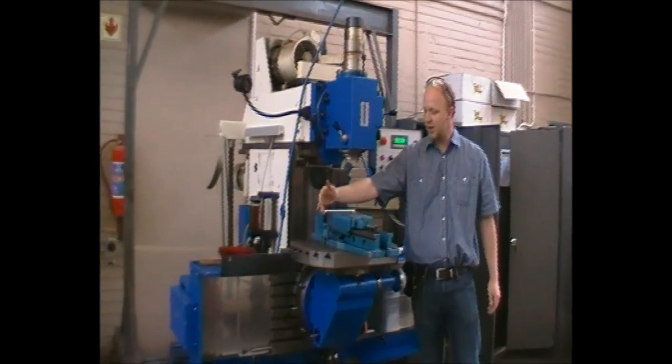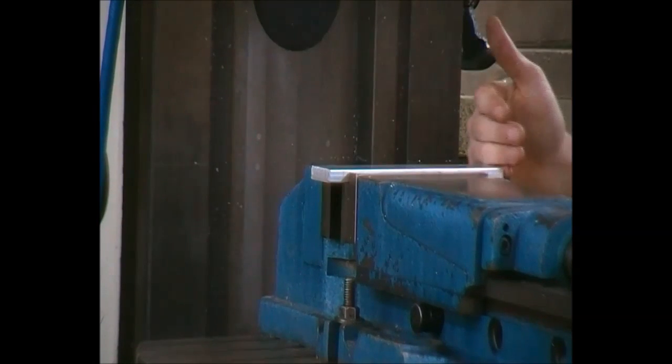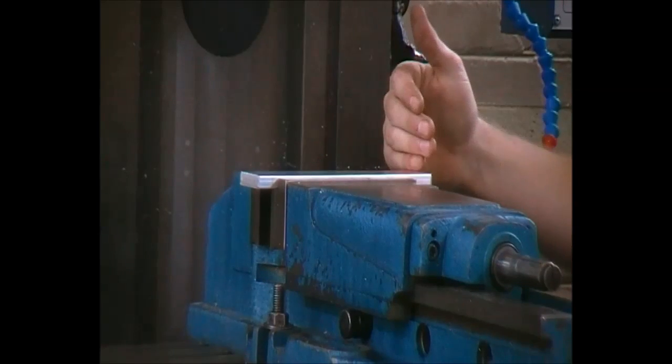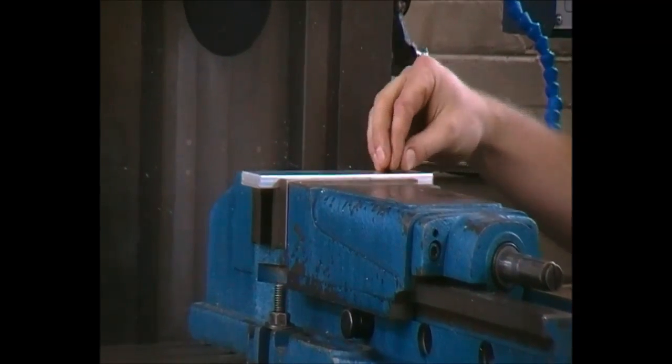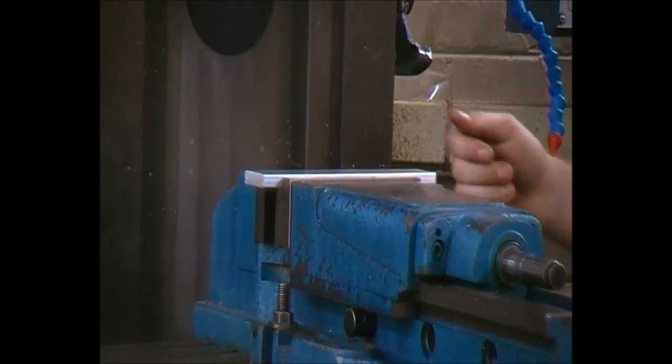This part is now secured tightly. We will now take a cut to the side so we have a parallel plane to the first side, which has already been cut previously. Then the center of X and center of Y will give us the center of the part where we want to drill our first hole. Let's put in a milling cutter now.